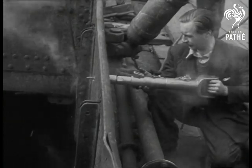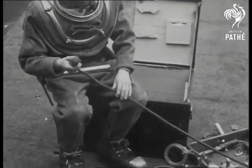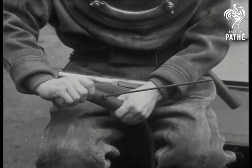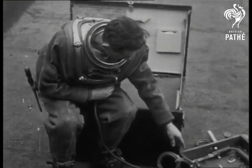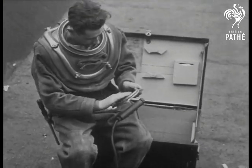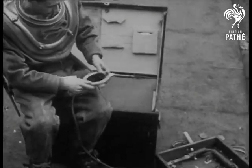A demonstration of the punch at work and the result. And now you're going to see the latest in underwater repair technique. A special electrode is placed in the watertight holder. The anti-glare window for the diver's helmet is examined to see that it's all in order. And soon the diver is going down under, equipped to weld underwater just as easily as he could in the air.